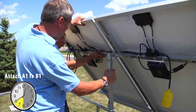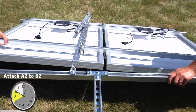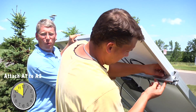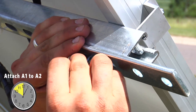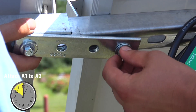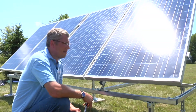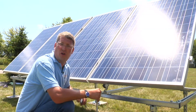The panel is going to rest on the frame until we get the A2 panel in place. Now we're installing the spring nut on the backside of A2 in final preparation for the splice bar. All the nuts and bolts are secured on the solar pod, so all the mechanical portion of this installation is complete. What we have left to do is some electrical hookup.